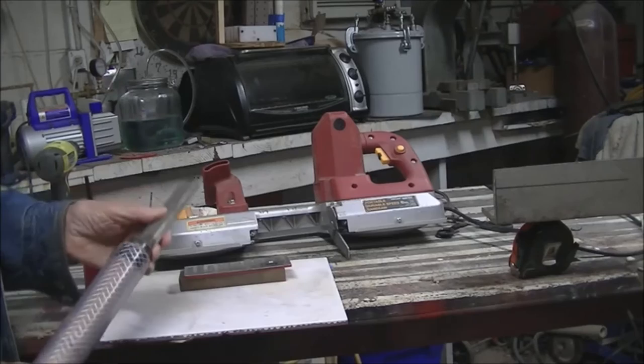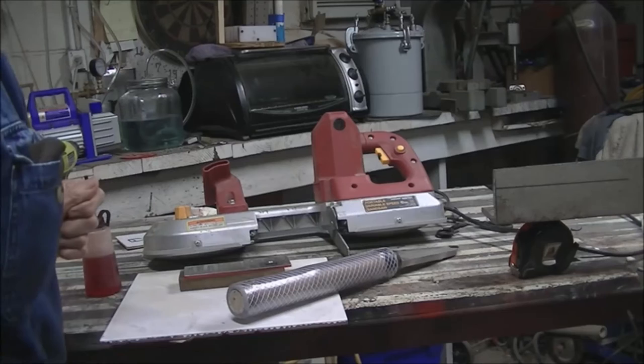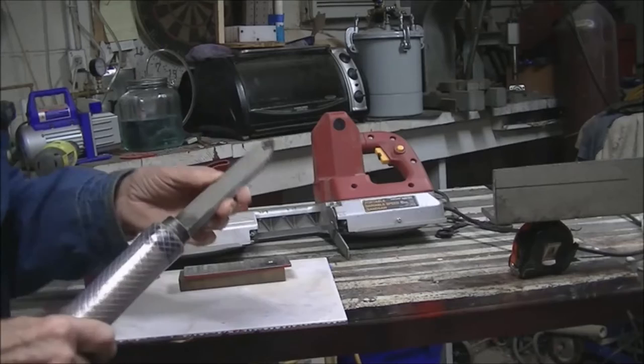So what I found was when I was using my square cutter, I ended up turning it sideways roughing to get the point to dig in, and that seemed to do pretty good. So I decided to build my own point tool, and I'm gonna call this my roughing pointer or whatever you want to call it. I wanted to show it to you a little bit.